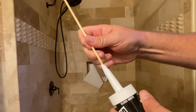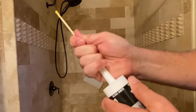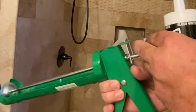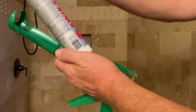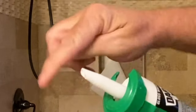You've got to go down into that hole with whatever you're going to use to puncture the seal — like so. You can see the caulk come out on it. Take your caulk gun, push the button on the back, pull the plunger all the way out, slide the back of the tube of caulking in first, and point your angled end down.